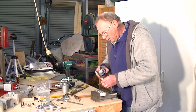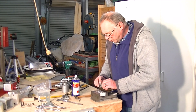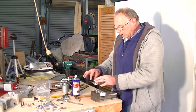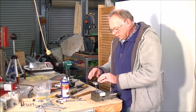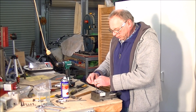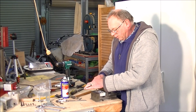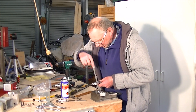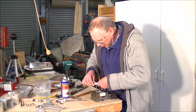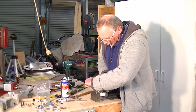You can actually put some on the tap itself. Now what you have to do is catch hold of the tap wrench with both hands like this and wind it up as much as you can. Try and get it into the hole very slowly and as square as you can. You need to push down very slightly.